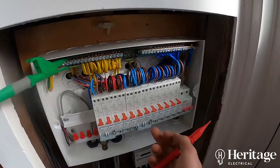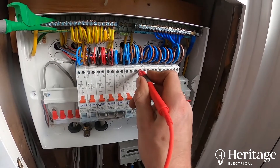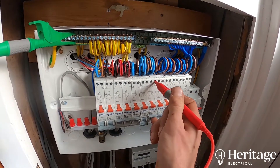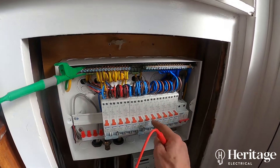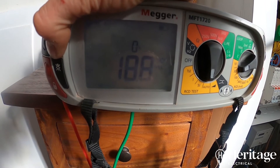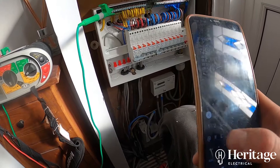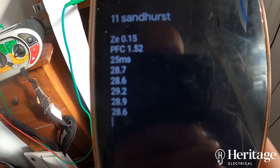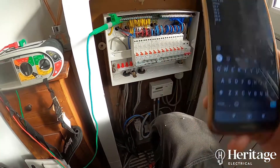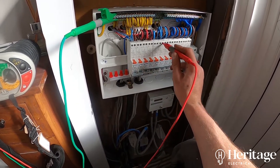Looking at some of these RCD tests — we do three different tests on the RCD just to ensure that it trips in the desired time. The RCD is rated at 30 milliamps. We do a test at half times the rated current, and we need to make sure the RCD doesn't trip so that we avoid nuisance tripping. We do a test at its rated current, which is 30 milliamps, and a test at five times its rated current — that's the value we note down, and this trip needs to happen within 40 milliseconds. The values are pretty consistent across the board, more or less within a millisecond of each other. With some other cheaper manufacturers you might get more variation, and that's maybe an indication of the quality of the manufacturing and testing process with the more expensive brands.